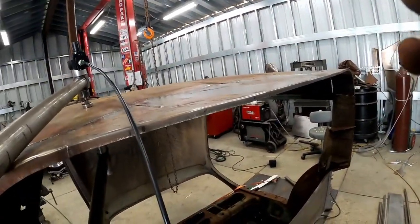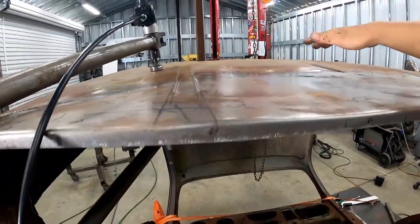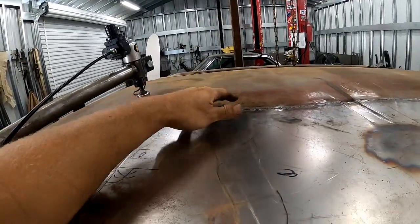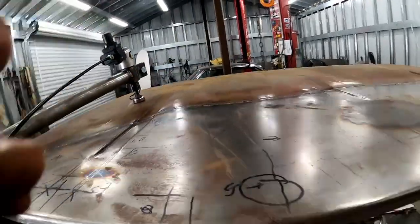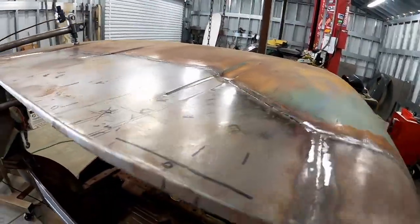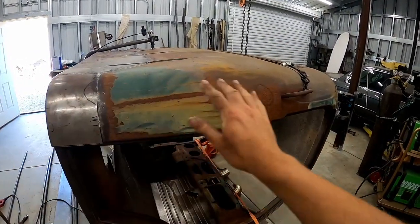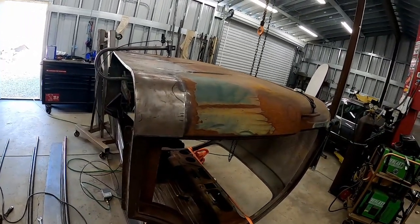As the stretching was going I started thinking it looks like it's stretched enough — it just needs to pop up. So I grabbed my hammer and dolly, held the dolly on the top side ahead of where I was striking, so the hammer was hitting back here and the dolly was up here pushing the downward peak of the weld up. It actually helped quite a bit — we're nowhere near as bad as it was. I think just some more longer stroking with the planishing hammer is going to help straighten it out even more, and then we'll see where we're at.